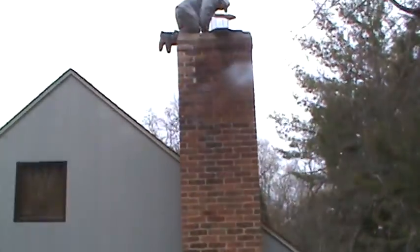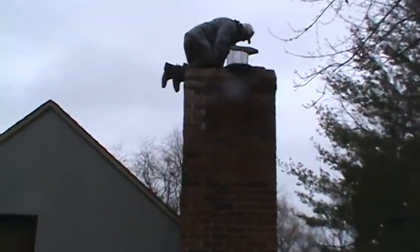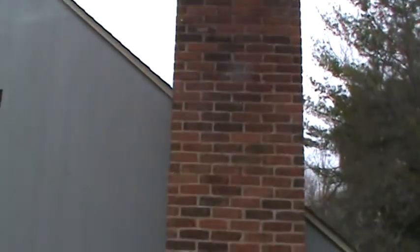We've got some chimney brickwork here — this tuck pointing area is failing. Right in here the mortar joints are opening up; this mortar work wasn't done solid. You also need mortar work at the top here — it's coming loose, coming right out of there, and it's all cracked. At the top, bricks are breaking over here on the back of it; bricks are crumbling and breaking.